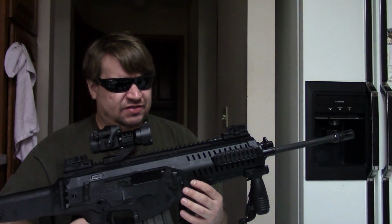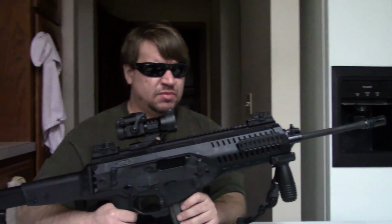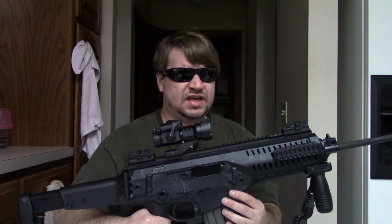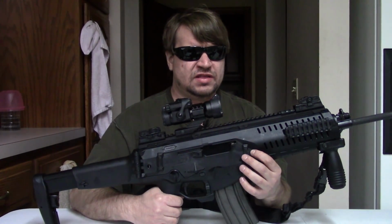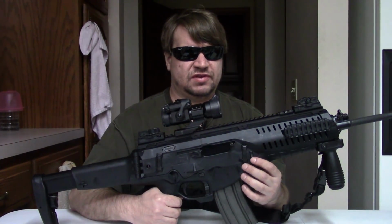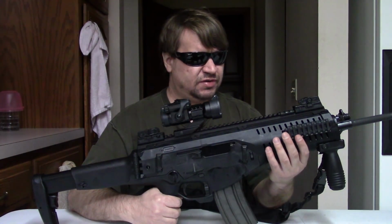Yeah, I thought he might want to share that. And we looked at the casing, and it looked like it was the ammo that had a ruptured primer, wasn't it? Yes. Yeah, so it looks like the primer ruptured and that did funky things to the bolt face and basically had a lot of gas blow back into the firing pin channel. And the gun itself was fine, but it goofed up the firing pin pretty good. So we're going to blame that ammo for that primer not doing what it was supposed to do.